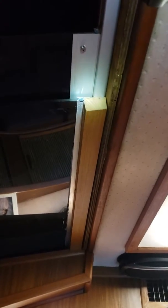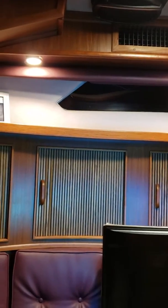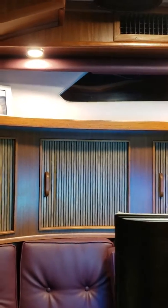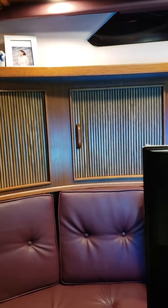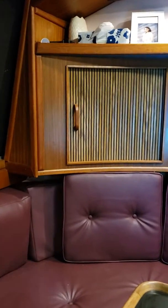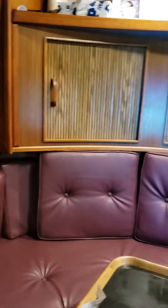Right. But this is stationary. This doesn't move. Right? This moves. And look at that. If you're pulling on the glass and holding it, it slides. If you're pulling it here. But if you're pulling it on the handle, it definitely binds. Right, and it's because you're pushing it in. You're not pulling this. You're pulling this, and it changes the geometry of the slide. When I first got the handle, that's when I first noticed the problem. Yeah. And it's because before I used to push on the plexiglass as I was closing it. Now I pull on it instead. Correct. And it just racks it.